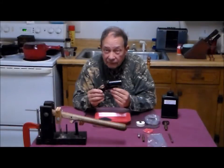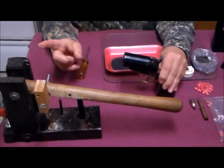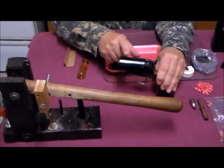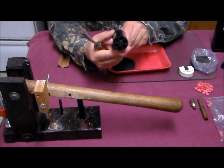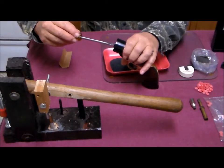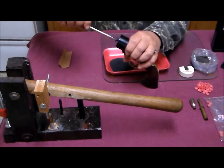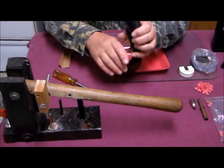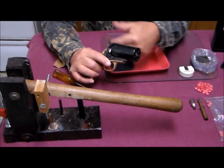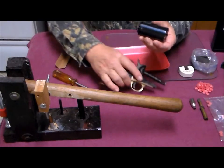So we'll go ahead and load up the gun. The Yank Pepperbox has just an elongated cylinder — it never did have a barrel. The barrel is not missing; it was just never made with one. The first thing you do is remove this pin with a fitted screwdriver. If you get one of these guns, the first thing you should do is fit a screwdriver to this screw so you don't bugger it. This screw is not under great tension because all of the firing pressures on this cylinder-barrel combination are directed forward. Then you put it on half-cock and just slide the cylinder straight off the gun.